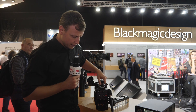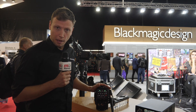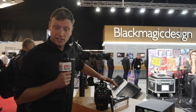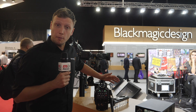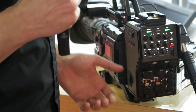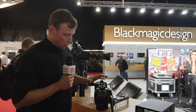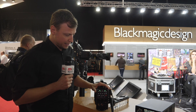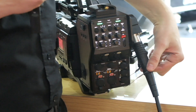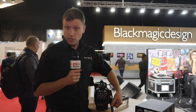I'm going to twist this around the back and show you this fibre converter, because this is an entirely new adventure for Blackmagic. When you work with a camera over long distances you have a couple of options: you work either battery powered where you're recording directly to the camera body, or you take a live SDI feed from the back of the camera and run that across a moderate distance. What this fibre converter does is it allows you to take a single SMPTE fibre cable which carries not only your video feed and your data feed, but also carries power over a distance of over a kilometre.